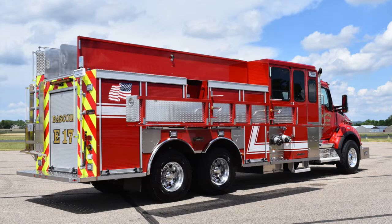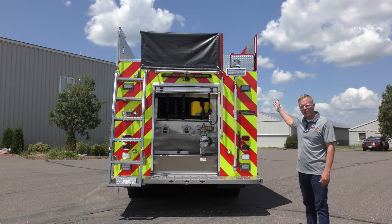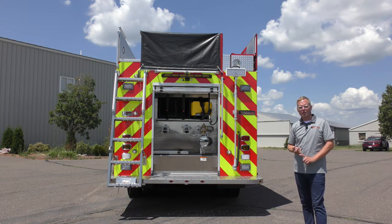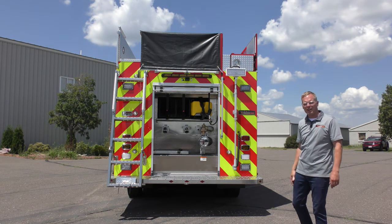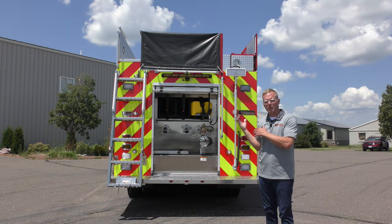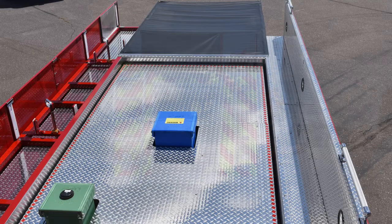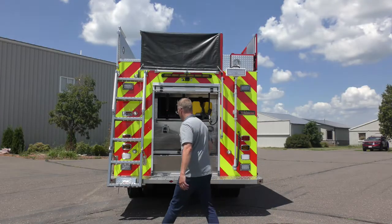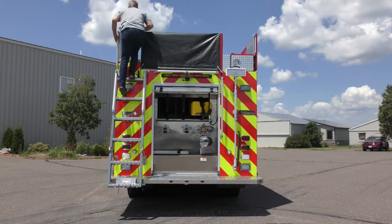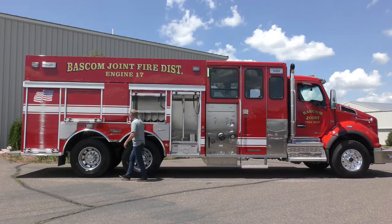The ladder rack is on the officer side of the truck — it's our center arm ladder rack. In this case, we're concealing everything with a parade panel on the outside, which serves as a mounting area for scene and warning lighting but also for the fire department insignias. Up over the tank is a pretty normal hose bed with a vinyl cover. And down alongside the hose bed is actually a walkway — an excellent feature. You climb up the ladder and proceed down the walkway so you have safe and easy access to the front of the body where your foam and water fill stacks are, but also your hose bed.